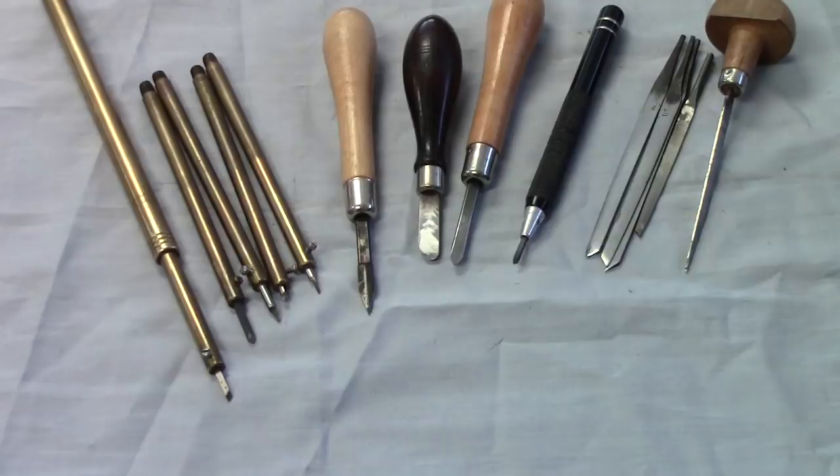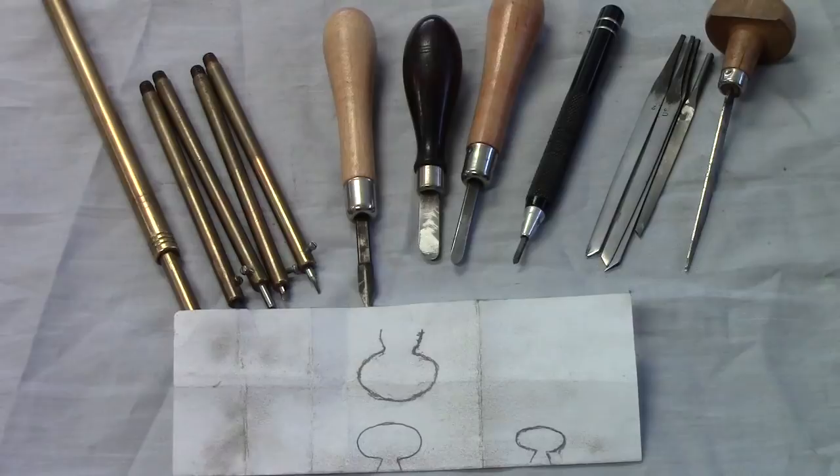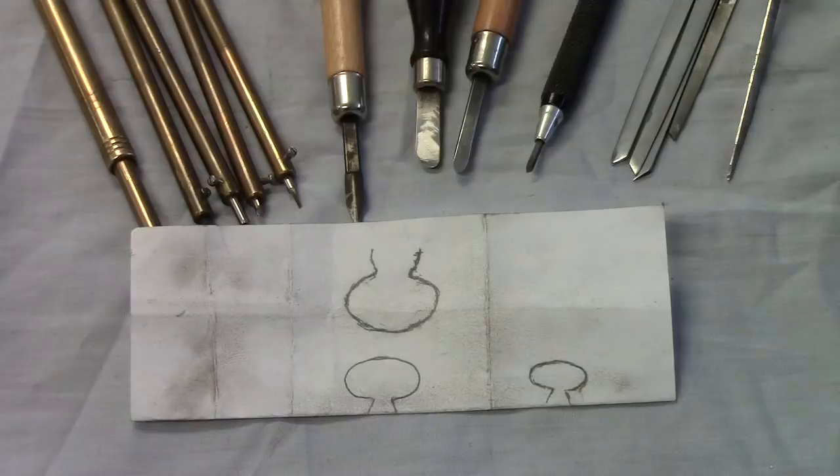Now, one thing when you're freehand turning, what I like to do, and you'll see it in the video, I like to make a sketch of the profile that I'm after. And I will lay this down on the bed of the lathe, and you can orient it such that by looking straight down over the end of the stock that you're turning, and with the nod of the head and a closure of an eye, you can pretty easily get the metal aligned to the drawing that's laying on the bed of the lathe, and just use it as a reference. This is the way I prefer to do it versus making a template and pushing the template up to the stock and checking it. This is more of a dynamic way, and you can see it changing as it's happening by looking at the profile.